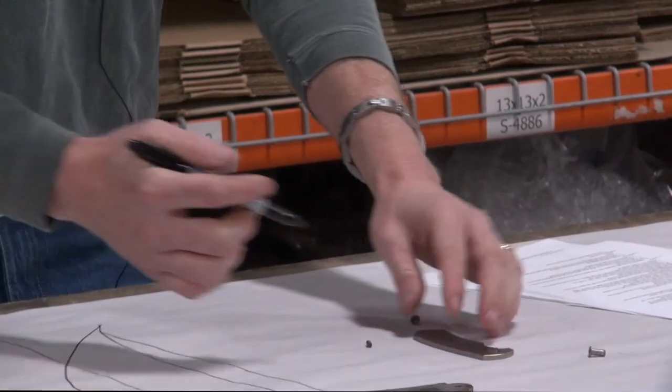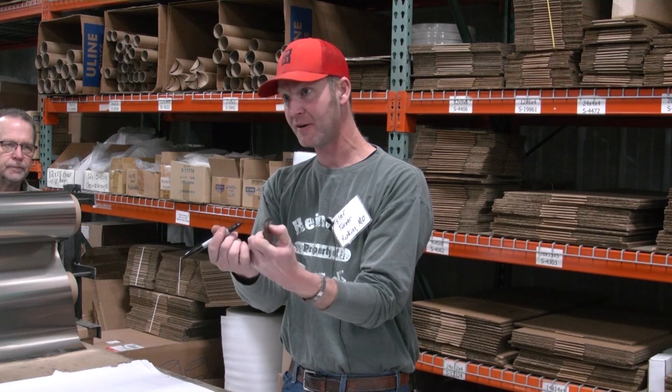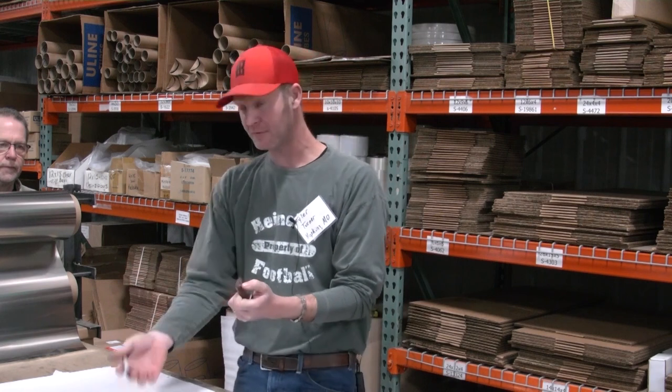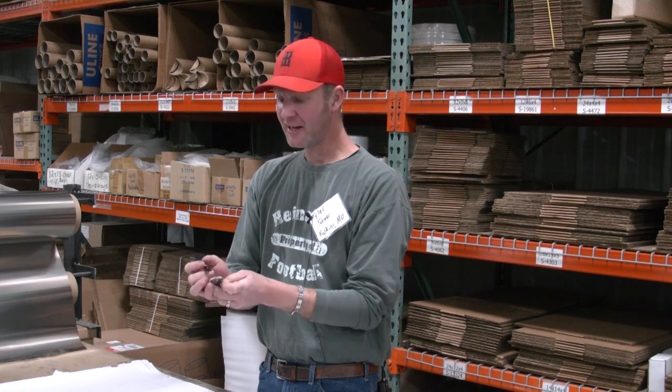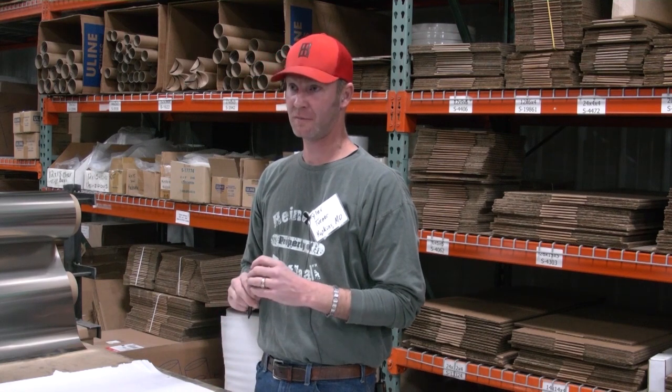And as a general rule, what I've done is 75 thou down from the lock bar lock face, 75 thousandths down, 75 thousandths over. Sometimes it doesn't work that way depending on the geometry of your knife. But that gives you plenty of meat so you don't press in that detent ball and then swell this face out, because it will swell. If you get close to 50 thousandths or something, you'll pucker that thing out that much, and you will do it very easily. So once you've got that established, I drill it with a 55 thousandths drill, and I always use carbide.